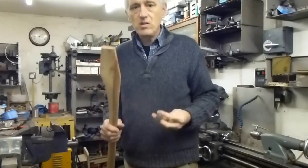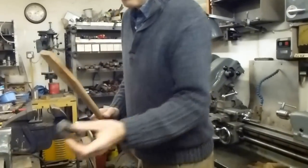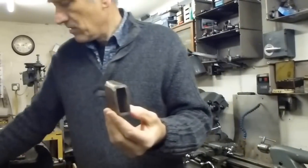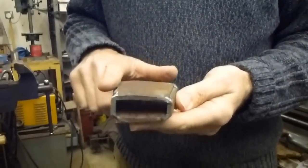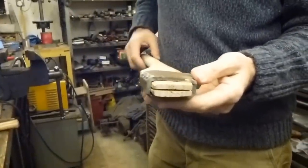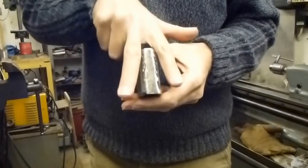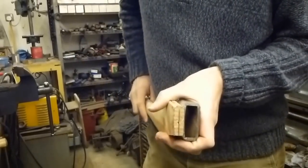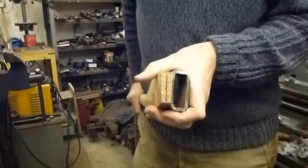Obviously I need to attach this to this, and the way I've decided to do it is to make a metal sleeve, and then I can weld that bolt on. The sleeve I've actually tapered two ways. First of all it tapers this way, which stops it sliding too far up the handle. But I've also tapered it the other way, so it's actually wider at the end. When that's inserted and I spread the wedge, it's very much like a pickaxe handle — it should really hold that tightly and stop it coming off.